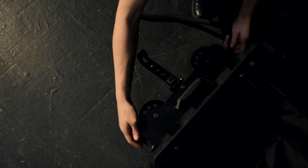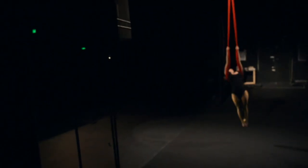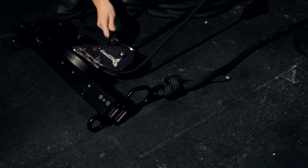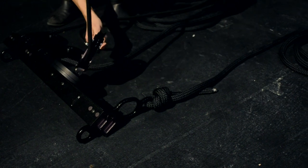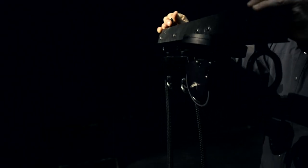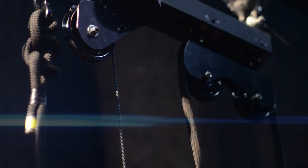The butterfly lift is adaptable to almost any rigging scenario. The components are automatically correctly spaced on the integrated head block assembly. The slewing pivoting payload block allows for countless horizontal approaches and the assembly self-plumbs. In almost any rigging configuration, the pulleys will automatically self-align to the rope direction.